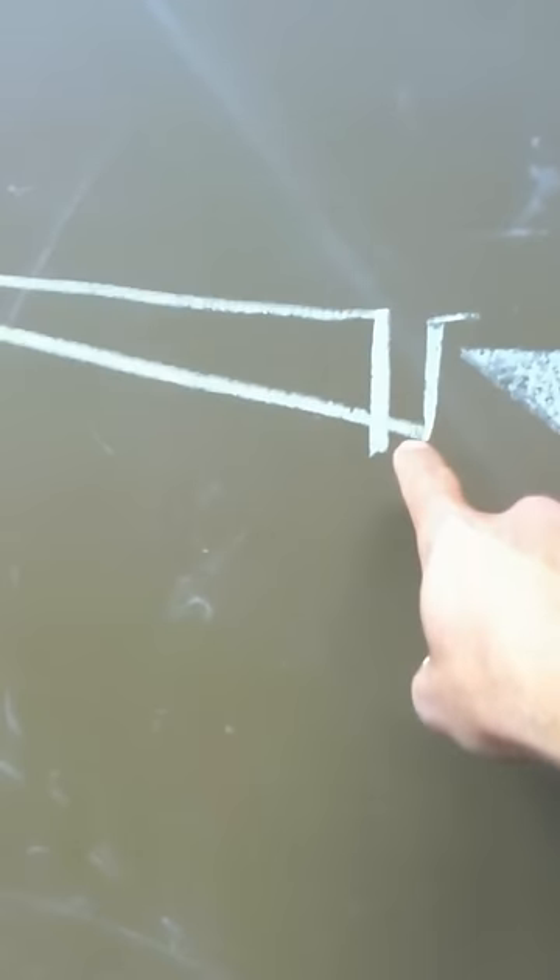Just to make sure this is clear, I've done a little diagram up here. Here's a diagram of the trap door. This is the latch, which is then set up with this trigger mechanism that goes all the way to the back of the trap. There's this bridge that the animal has to walk over in order to not set off the trigger mechanism until it is at the back of the trap.